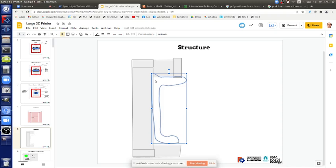That stuff might break off, unlike the fiberglass, which will be more breaky. But maybe we could just do it with the brown rock wool that we have here already. That's actually rock wool, too. It's not the fiberglass. That's the flaky stuff, though, right? The real small. Yeah. But it holds better because you get little chunks off this rock wool and it doesn't like to stick together. The fibers are shorter, it seems. I know the stuff they make the planting blocks out of is solid. It doesn't come apart particularly.